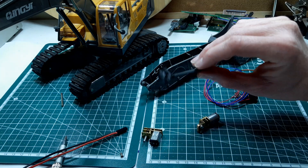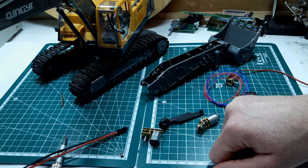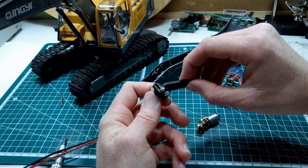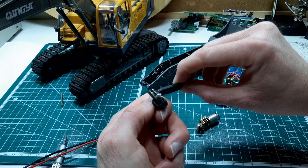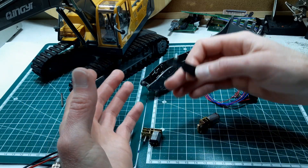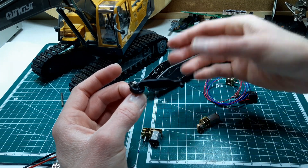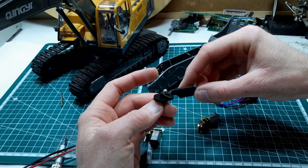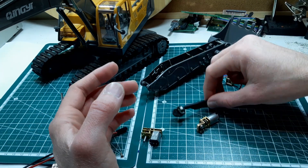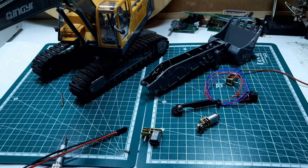So that was just a little 3D print I had done today - I just wanted to see how that worked. It hasn't perfectly solved our problem, but we're kind of on the right lines. This mechanism can go to full 360 degrees without the motor hitting a hard stop or anything, so you don't have to worry about limits because there is no limit. Once it gets to this point, it's freely able to move on to lowering the bucket again. So if we could get a nicely geared motor with plenty of torque, I think this mechanism would be ideal for this particular model.